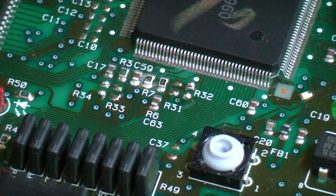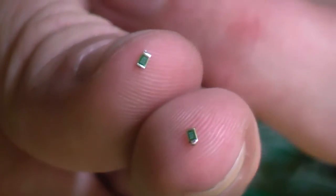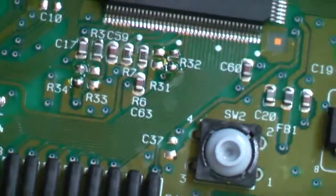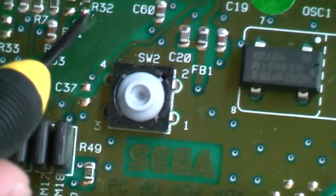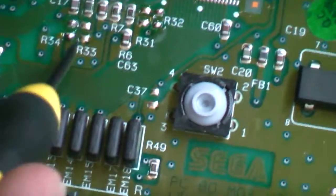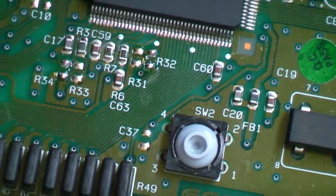And that's two gone — nice and easy. There we go. You can see how tiny they are. So what that leaves us with now, if we come a little bit closer, is our four points. You can actually see with your eyes what happens — one track leads off to the Sega 315 chip, and the rest go off: one goes to five volts and the other one goes to ground. So we'll just get some wiring attached and then we're just about done with it.